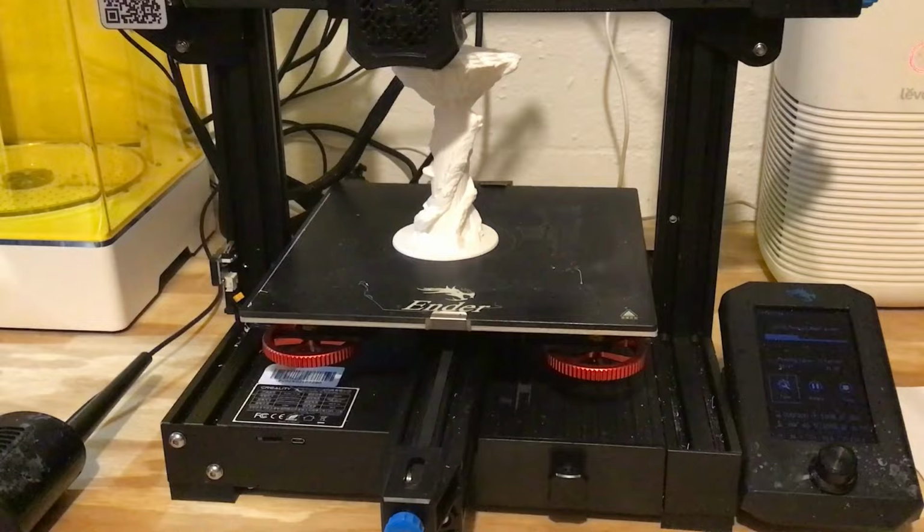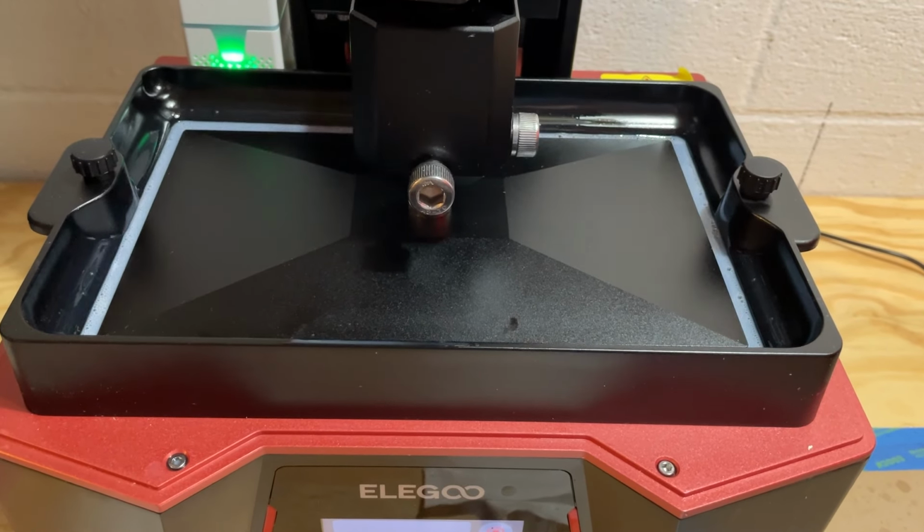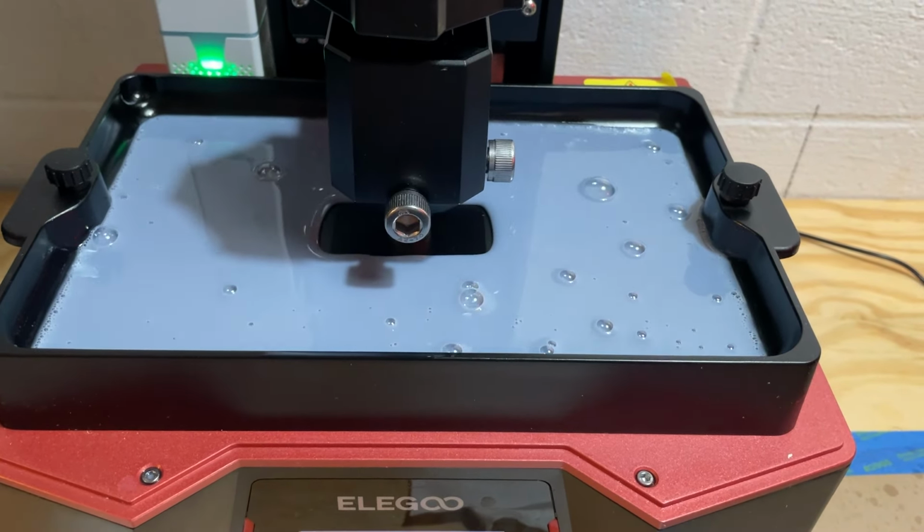There are a few different kinds of 3D printers. Largely, they're put into two categories, SLA and FDM. Both of these are better at doing different things. FDM uses filament typically on a roll which feeds into a high temperature extruder, sometimes called a hot end, and places material on a bed layer by layer. SLA uses lasers which project an image onto the bottom of a bath of resin, and this adheres to a plate that continually moves up.